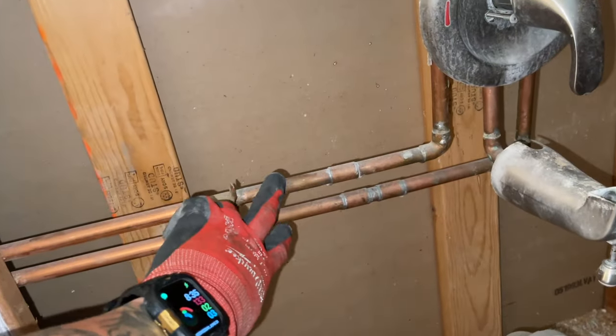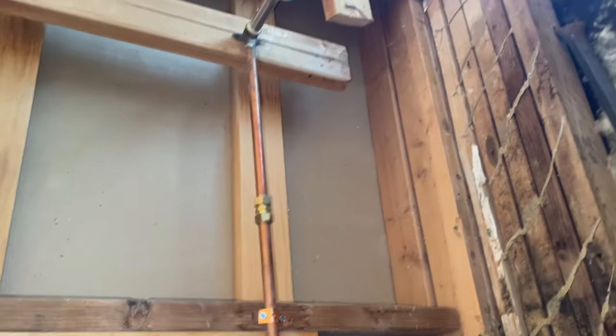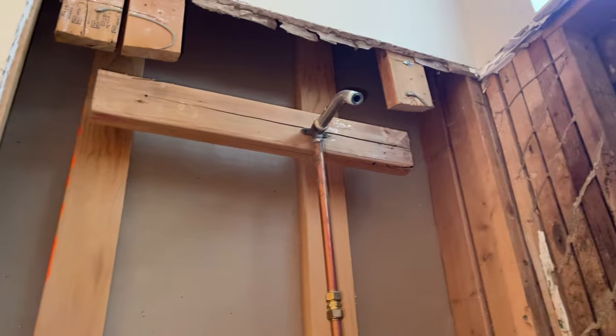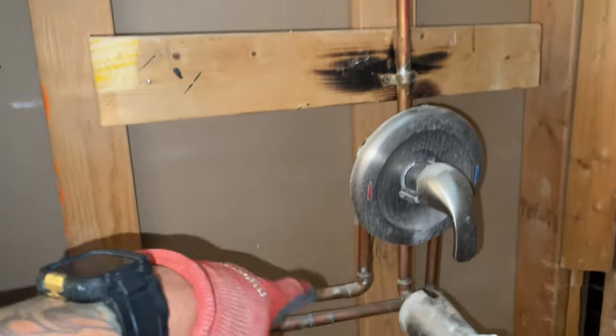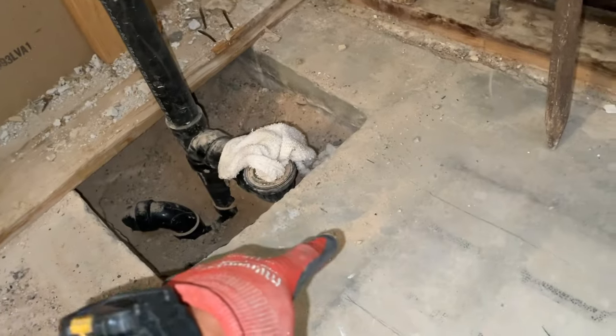The next project will be actually cutting these and putting in a new valve — it's going to be a little bit higher. You can see the work done here; it's pretty bad from the previous DIYer or handyman. But we're putting in a new valve, and we're going to run PEX — going from copper to PEX — new valve, shower head, body spray, and floor drain.